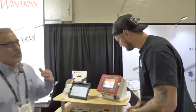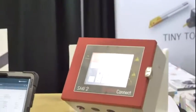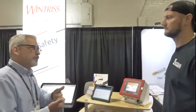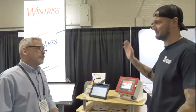This allows the operator to specify why the machine is down. They pick off a list — you create a specific downtime reason menu for every machine and it's consistent across the board, so you know 'waiting for QC' or whatever reasons are on there. If the machine is stopped longer than the preset amount of time, we bring a downtime menu right up on the screen and we inhibit further machine operation until they select the reason — they have to fill out the report. And since it's a drop-down menu, they're not wasting a lot of time.